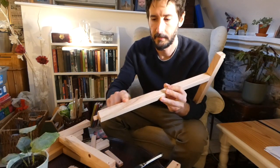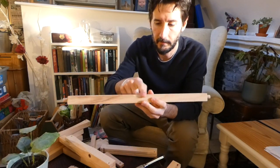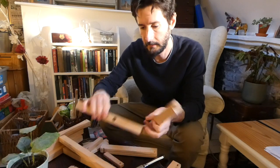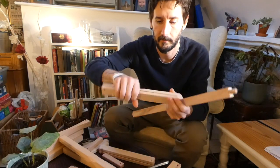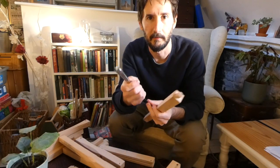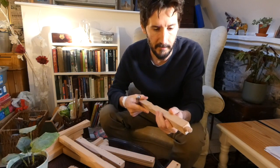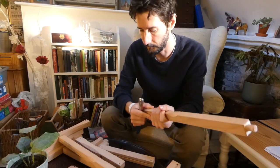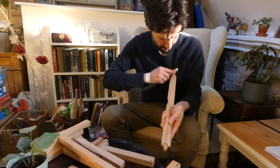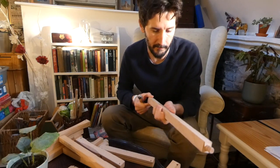I chamfer all the edges and then carve little notches in the cross pieces where this bit will sort of rest, and then I carve the handles as well. The last thing I do is I always just take the handle of a metal knife and burnish all the edges, just to soften them up a bit, because it still doesn't feel too nice in the hand. I just go over every piece like this and it leaves a much nicer finish — it feels a lot nicer.